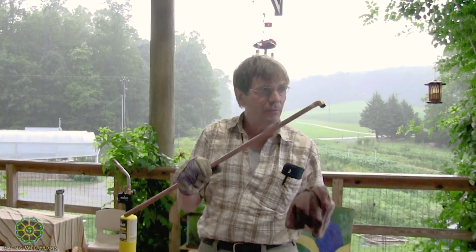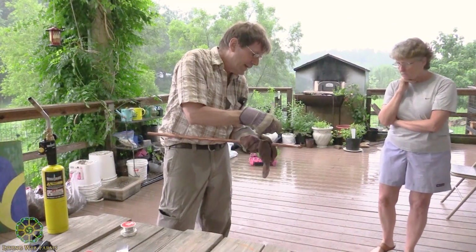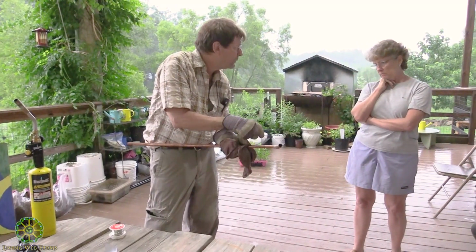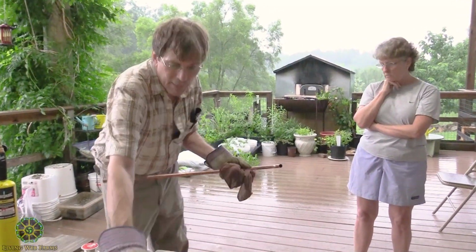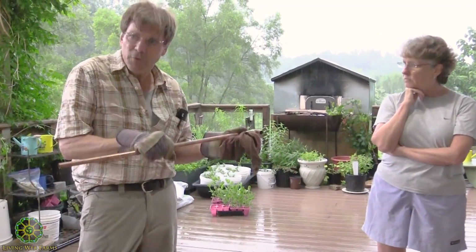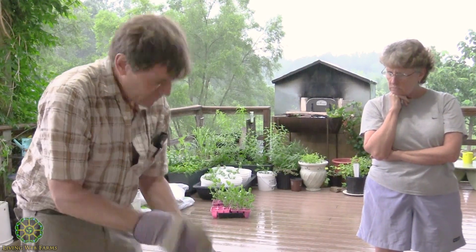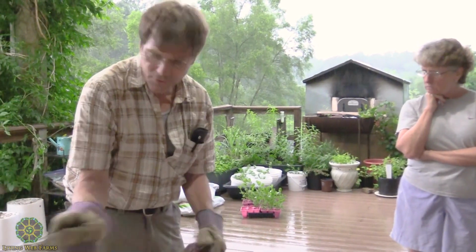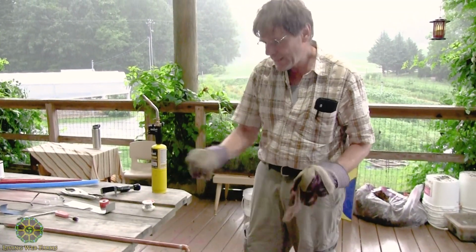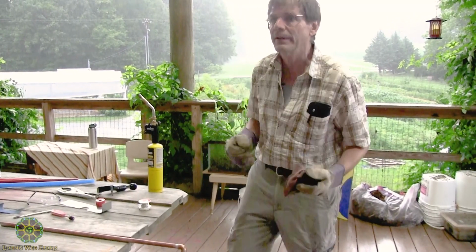If I wanted to fix this, and that happens, say I decided that angle is wrong, I wanted to get this angle right, and I put a black magic marker here, and then I put another one on the pipe to make sure I was doing it right, and then somehow in my fitting I knocked it off wrong, and I still soldered it, and then I noticed I did it wrong. All you have to do is put it back down again, put the heat back to it, get your pliers and your glove, and pull it off again. And then heat it. The copper will all sort of spread out again. Put more flux on it and just do it over again.